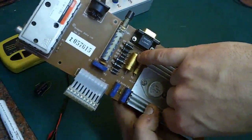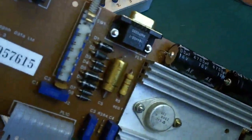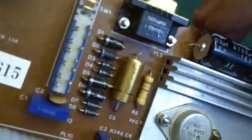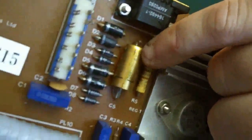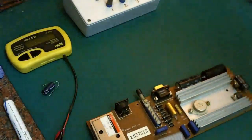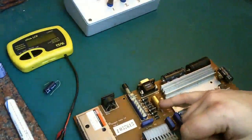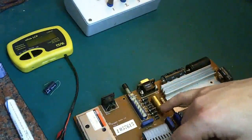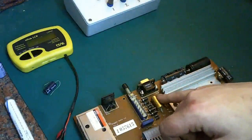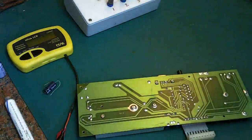We'll start the correct way. We look where the capacitor is on the board, flip it over, and we can see the two connections. It's screen-printed on the board — there's a little plus to indicate the positive, and if you look on the capacitor it's in the same position. That's how to tell which way around to go, because these electrolytics are polarized — you don't want to put them in the wrong way. The positive is up at the top.